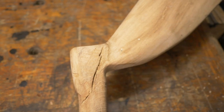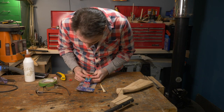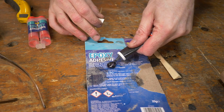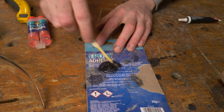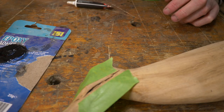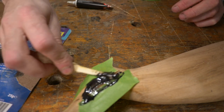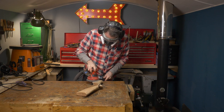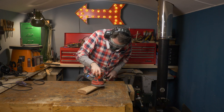The stock has a few cracks in it and I'm going to fill these with some epoxy. So I mix some up and add some black food colouring to give it a little tint, then fill all the cracks and just leave it to cure. When the epoxy's dried, I can come back with a random orbital sander, then some final hand sanding before getting the finish applied.